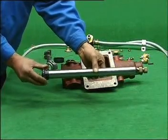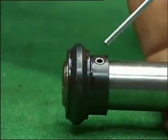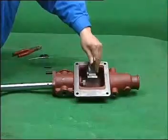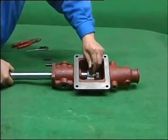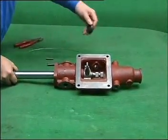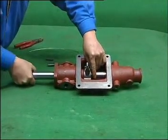Install locating ring onto horizontal shifting lever and put spring placket pin into the hole of the locating spring. Slightly knock it flat. Pull the horizontal shifting lever into double H housing. Attach plug onto the horizontal lever and install reversing control piece onto horizontal shifting lever. Make sure the pinhole on the controlling piece is against the hole of the lever.